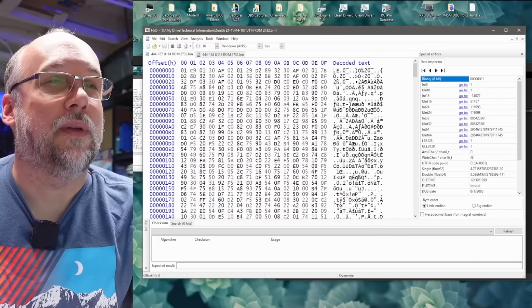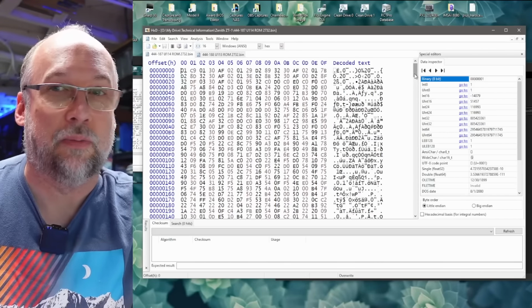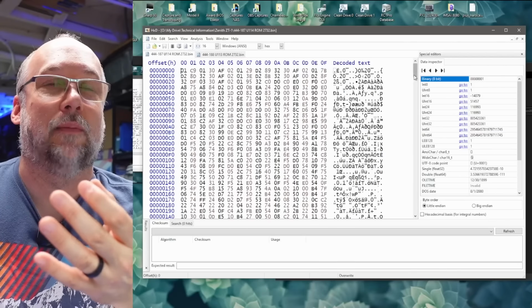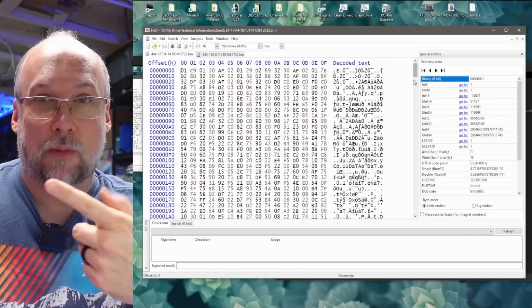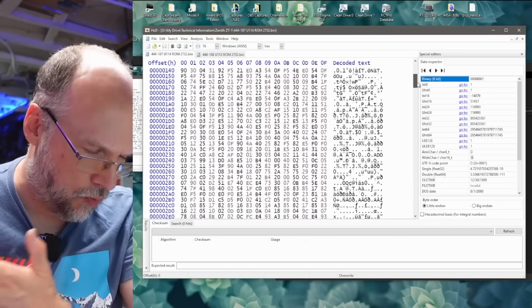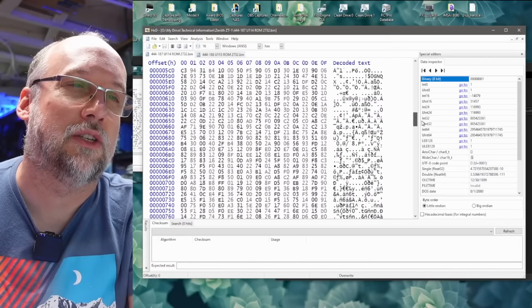Well, both ROMs have been dumped and the contents look fine. I don't see anything that's obviously wrong. Plus I did multiple verified passes on both chips and it was able to read back consistently every single time. If you have weak drivers or other issues in an EEPROM, reading it multiple times can sometimes change the results. So you can do the verified passes. But the first chip, which was the one on the left, just looking at it, I have a bunch of stuff, which I guess is code here.